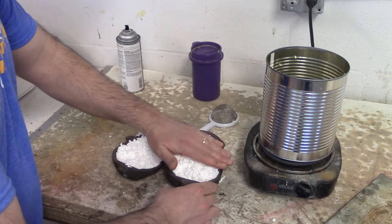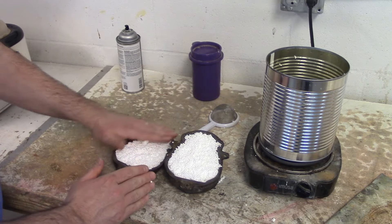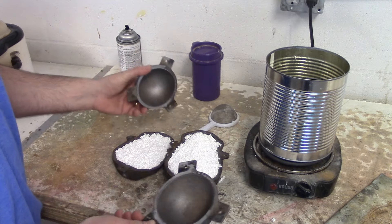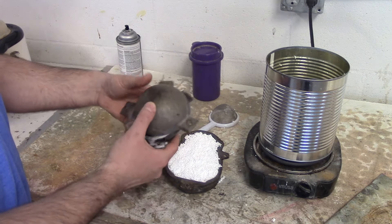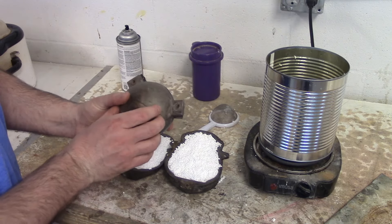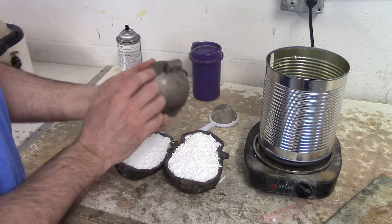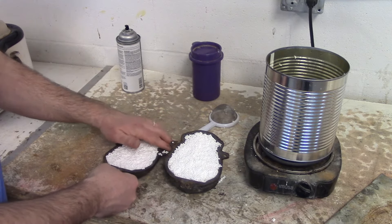Let's see the trick on getting these aligned. This mold is not symmetrical — there's only one way to put it together. If I were going to do a softball, I'd have to make sure that the softball molds belong together and are indexed correctly. In this case my indexing mark is a band. I can see this one also has a band, so I know these are indexed correctly when my holes line up and my band lines up. That is the only way this mold goes together — the band is all the way around and my holes line up.